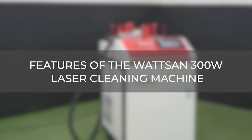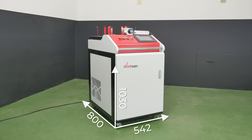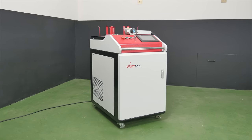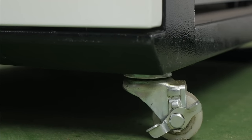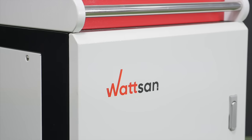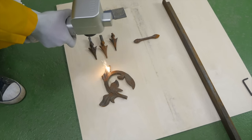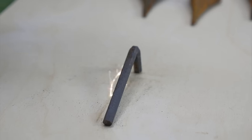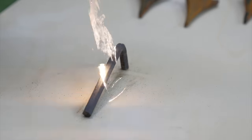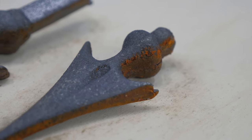Features of the Watson 300W Laser Cleaning Machine. The machine has the following dimensions: 800 x 542 x 1,030 mm. It is equipped with sturdy wheels that can be secured. The Watson 300W is a pulsed laser cleaning machine, meaning the laser affects the material with short, high-power pulses that vaporize or destroy the desired layer. Pulsed cleaning has a greater adjustment range than continuous cleaning, but with less power and therefore lower productivity.